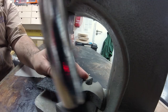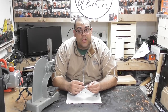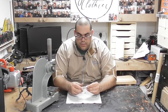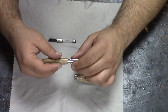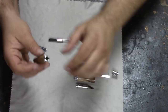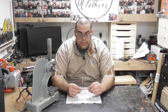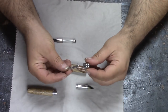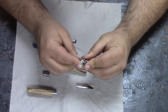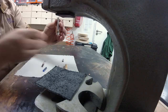I'd like the clip to run across through the center of that dark section, so I'm going to aim for the nib to go in at that point as well. I'll use my arbor press to push it together. Before I unscrew the other section, I want to line these two bits up so I'm happy with where they are — about there. I'll lightly press it on, then unscrew it, remove the nib, and then using the arbor press put it into position. Now I can attach the clip.